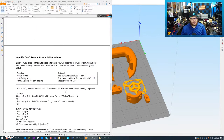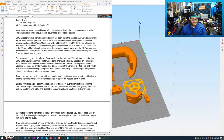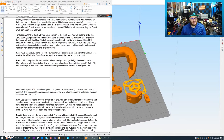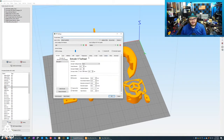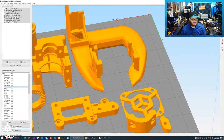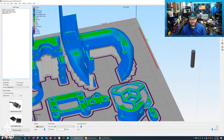He's got a full list of all the bolts you'll need — the kind of stuff we're going to source and sell in pre-packed bags as full kits. For printing the parts, he recommends 35–50% infill; the direct drive adapter should be at 85% or higher. Use automated supports from the build plate only. Lightweight cooling ducts need a few well-placed supports inside the part, not down into the duct. Let me show you what happens with auto supports.